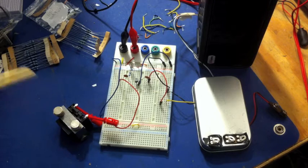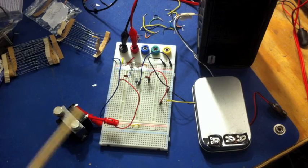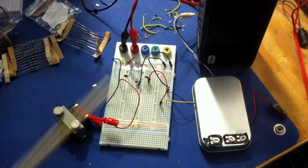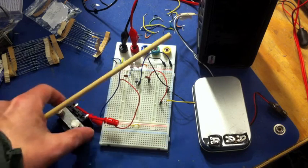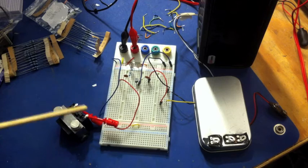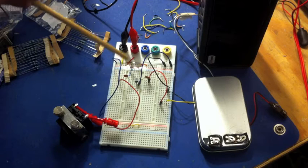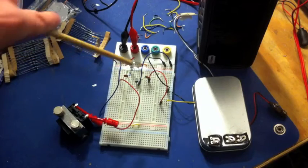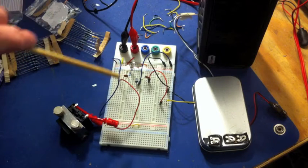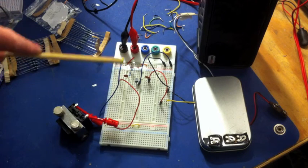First up, what I want to do is just explain the setup that was able to make that sound through the pickup. So temporarily, while I'm waiting for the bits to come through, I've just bodged something up so that we can see that working. What I did is I took the pickup here — the mobile transformer — and I've connected the two leads to a little preamp. This preamp is built from two capacitors, two resistors, and a transistor. It's a really nice little circuit.